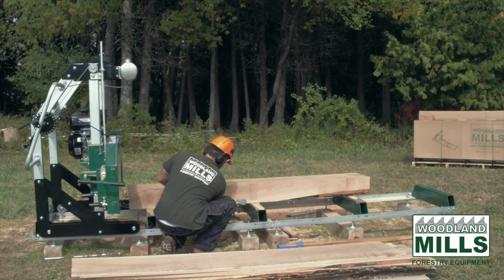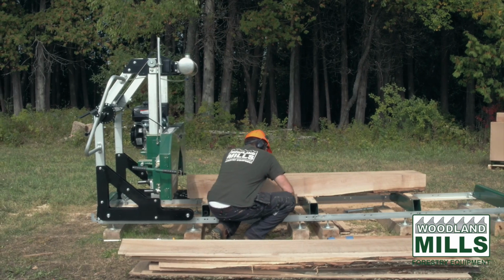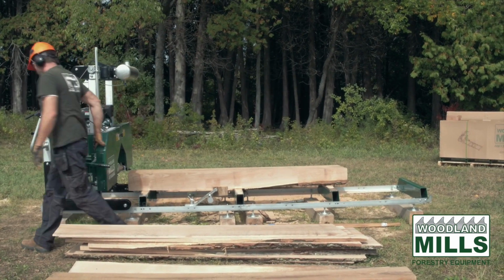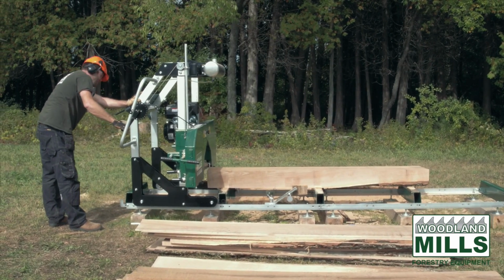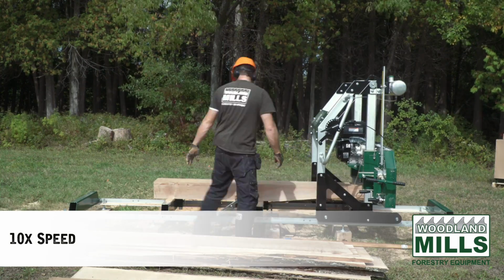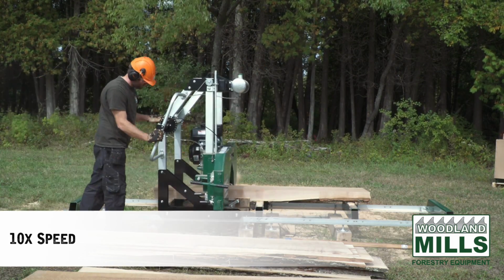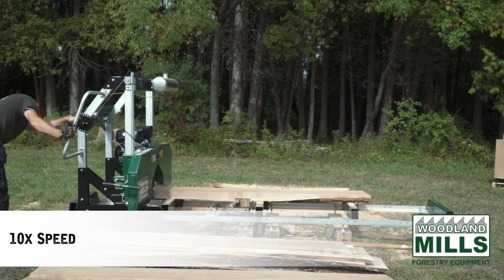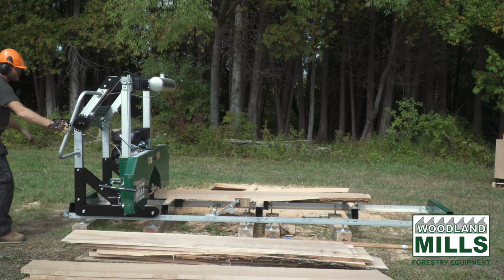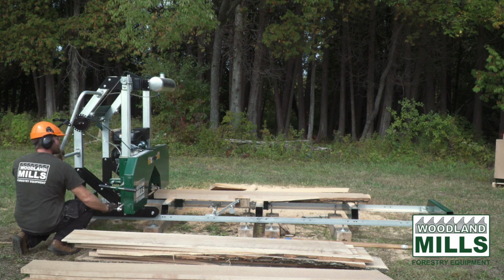Now when I'm doing the last clamp, I can set this board so I don't do any damage still. And if my blade gets too close to the board, it'll just take the board off. Take one off the top and leave the bottom board the right height. So pull out the adjustable blade guide, get around my clamp.